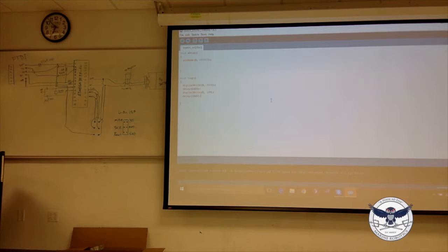If you want faster pin access without learning direct port access, there's an Arduino library called digitalWriteFast. It basically removes all those safety-check lines of code in the standard digitalWrite, and just assumes that you know how the pin is supposed to be used.